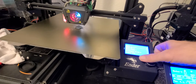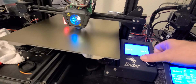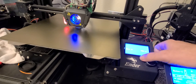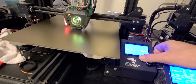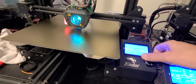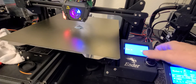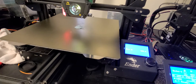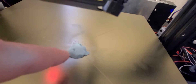This is the easiest way to do this. Go to Motion, Move Axis, move your nozzle a little closer — move it just down into the play-doh or whatever you have. Then bring the nozzle up and you'll see what we have. Now we have an indent of our center location — pretty cool, right?